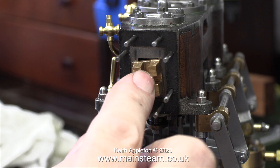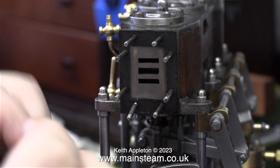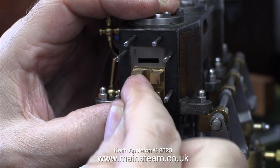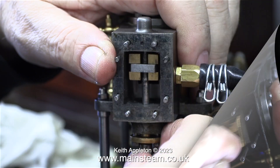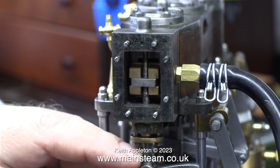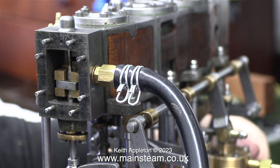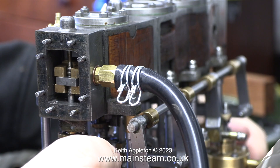I do not like the look of these shiny marks on the port face at each side. This could mean that the port face isn't flat, but all I have to do is remove the studs and then flatten the port face manually. What I'm doing here just as a quick test is moving the slide valve up and down to see whether any new marks reappear on the valve. I'm not going to take it that far for the moment though — I'm going to put the engine back together and see if it runs. If it does run and I don't detect the blowing sound as before, then all is well. The valve is not bad — it uncovers the ports more or less equidistantly, and by adjusting the eccentric sheave I can get the valve timing right, but only in one direction. That's why I'm definitely going to make separate eccentric sheaves.